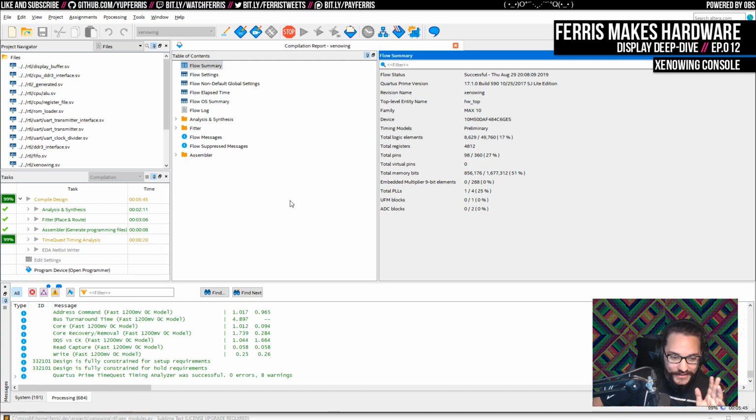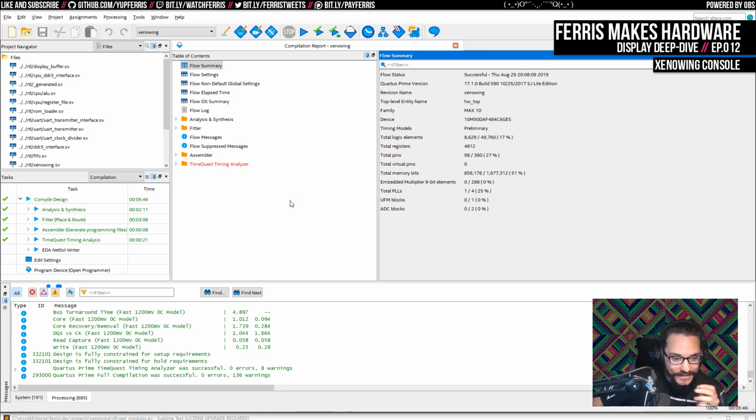I also want to do everything with integers. I'm thinking 16 by 16 fixed point. Yeah, that's kind of what I'm thinking so far. After that, I do want to have some kind of shader support, which I'll probably initially implement register combiner style, and then just sort of expand on that. Maybe, I don't really know yet, but the way I'm thinking at least is how the pipe will work, and that getting clear through that pipe is kind of the first vertical.